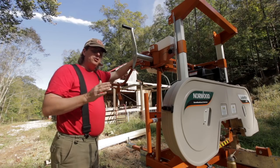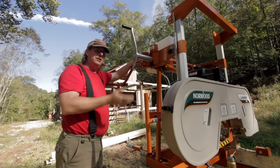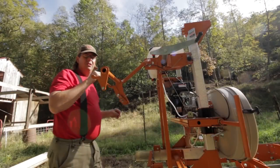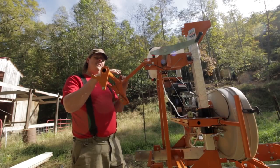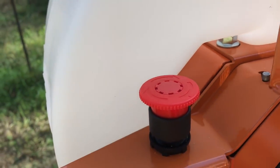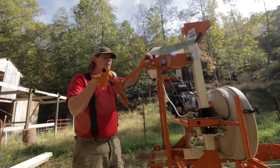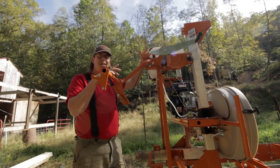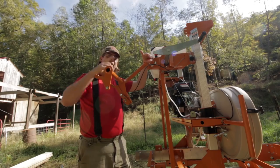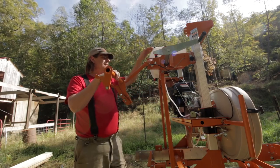While I was a little unsure about that tensioning system at first, I love that they've eliminated the extra clamping steps. If this tensioning system holds up as well as it has so far, it's a win-win — it makes it a lot easier to raise and lower the carriage. Another feature I like that seems kind of simple but didn't have it on the old mill is a kill switch — just a safety emergency stop. It's hooked up to the ground system and oil sensor on the engine. If you've got something in a jam or a bind and you're waiting for the engine to cycle down, you can just hit this to shut it down easily, rather than reaching in for the key.